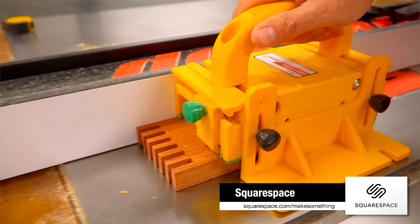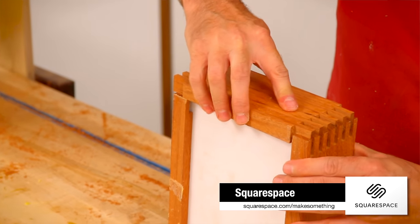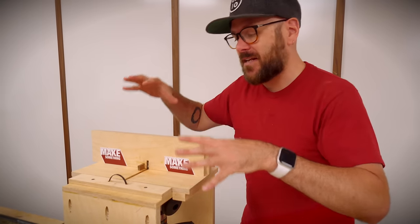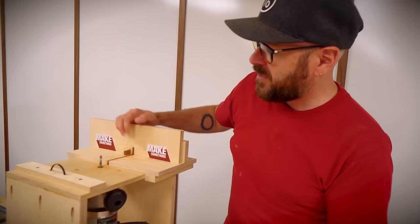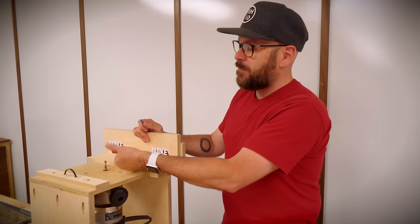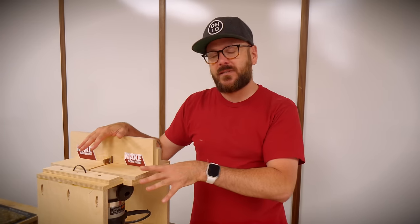So we are going to finish this box up. I'm going to take it over to the table saw and cut a little groove so we can put a bottom in there. One thing to keep in mind is the bit length — this is the bit I originally wanted to use, but it did not come up far enough to box joint three quarter inch material, so I had to find another bit that was a little bit longer. I'll try to find a quarter inch bit on Amazon and post a link below. Also make sure that this base top is made out of half inch plywood — if it were three quarter inch plywood, the bit might not come up far enough. You don't need plans to build this, but I will have drawings up on my website.